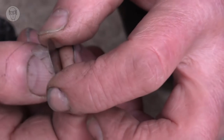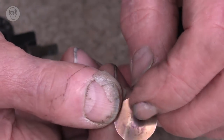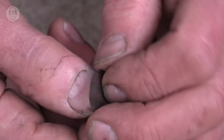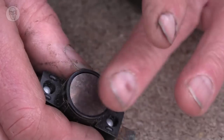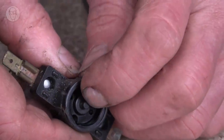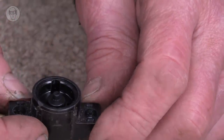And what happens is, when it heats up, this side expands more than that side, and it reaches a very particular temperature, the switching temperature, and suddenly it pops. So instead of being domed out the front, it's domed out the back. And so it touches this lever on the switch, which switches the sensor.